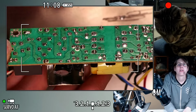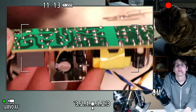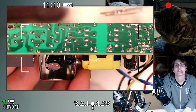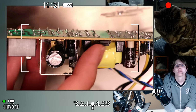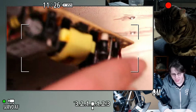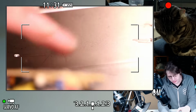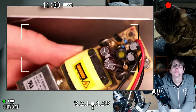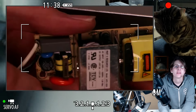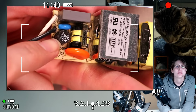It's a cute little power supply. Oh, there's the optocoupler. That's such a nice little thing. So it's got feedback, it's got some good isolation. I remember these being actually pretty legit power supply modules. Really bunched together on the input, or, that's the secondary side. And on the primary side, fused in one of these little cylindrical packages.